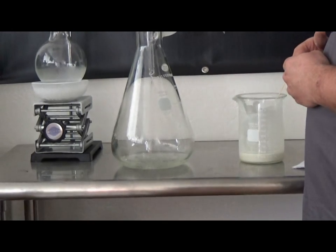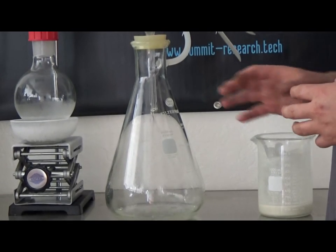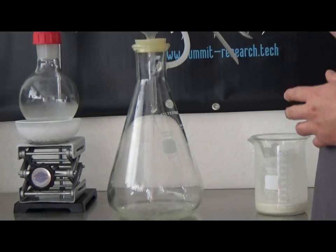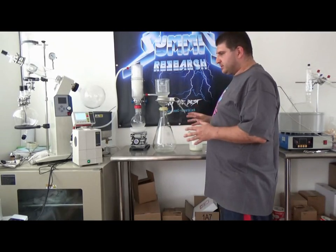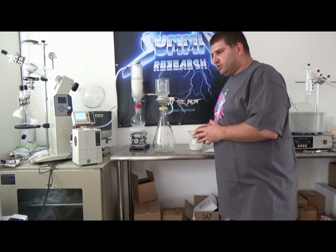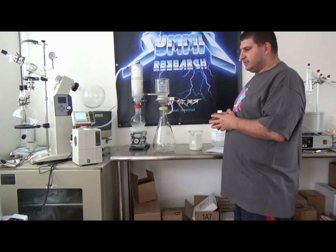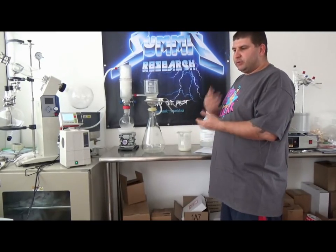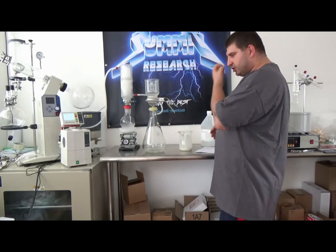With a heavy solute you have approximately one percent less flow — we don't really see it slow down beyond this. You can run cold waxes, carbon product, bleaching clay product — any kind of product can go through here and it will come out crystal clear on the bottom with everything left behind. Whereas normally you would use glass wool for initial wax removal, in this case we would have a heavier particulate like carbon that would bog up the filter, but the carbon would normally float around and the rest would flow through.